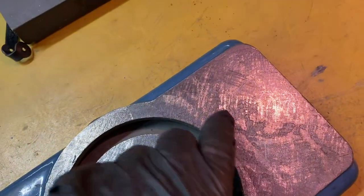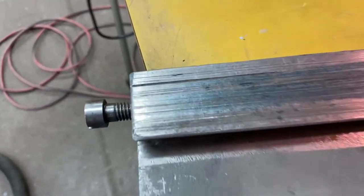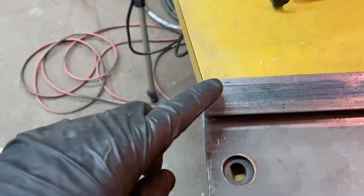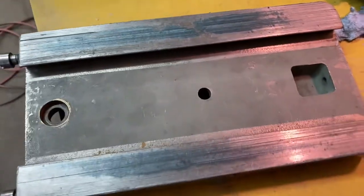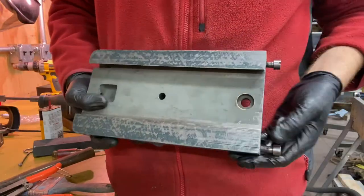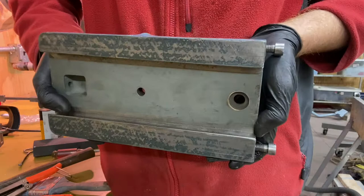You can still kind of see those lines where the machining pass was on the cutter from the mill — I don't feel that's worth pursuing any further. Flipping over to the other side, this surface just looks terrible — you can see where it's gotten a lot of galling from chips. I had thought about milling this down but I think I'd just get into more trouble, so I'll at least try to knock out the high spots and see if I can get even coverage. I've got pretty good coverage now except for this hole over here where it's worn — still haven't picked up anything there, and maybe a little bit in this area on this side as well.